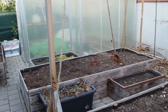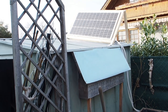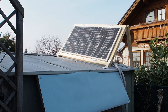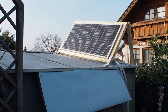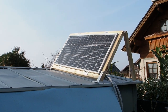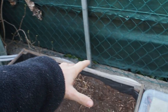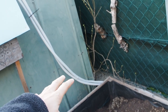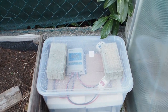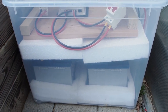Okay, so this is my garden. There's nothing much going on here, but as you can see, I have installed this really nice solar panel, which is now dirty from the sand that we got from the Sahara desert from Africa. So yeah, this is my 100 watt solar panel, which I have installed a couple of days ago. The cables are going down here — they are actually four square millimeters thick — and this is the box where I keep the solar charging unit, all of the breakers, and two 60 amp car batteries.